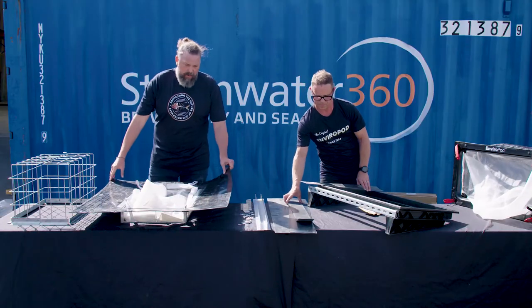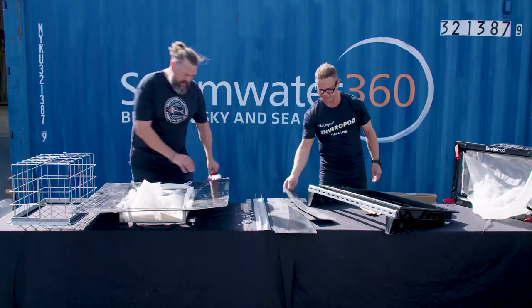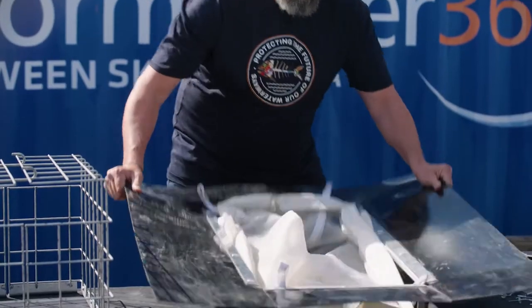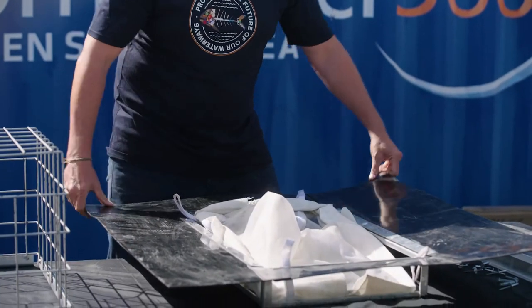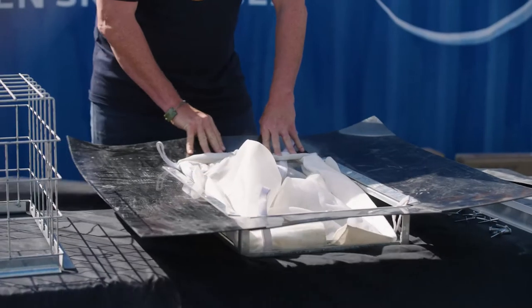The seals were actually a bit of a nightmare in the old design. They generally had to be cut with an angle grinder since thick plastic was required. Locating the system on the struts meant cuts had to be near perfect, and there was a real lack of flexibility — positioning was always a challenge.